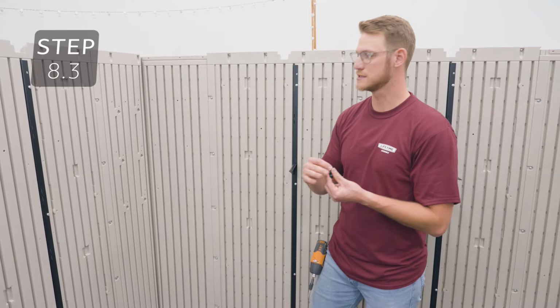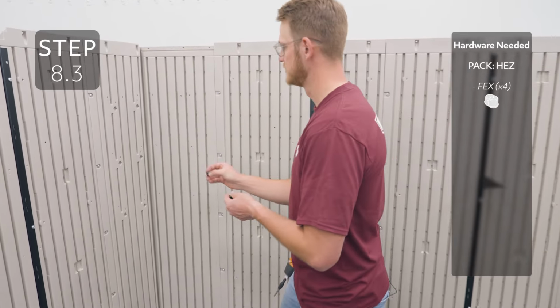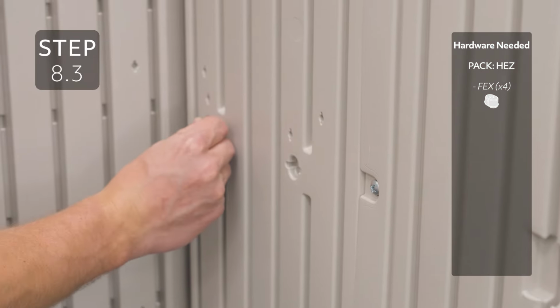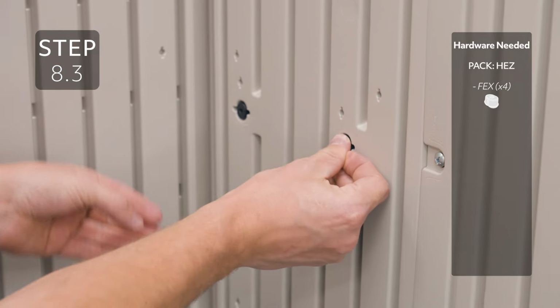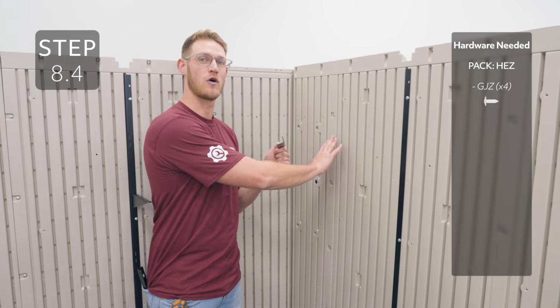Insert the screw anchors into these divots at the same height as the triangular shelf bracket on each corner. Secure the shelf support brackets to the screw anchors, making sure the oblong hole goes against the wall.